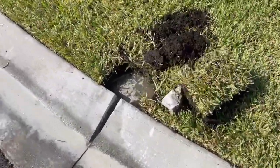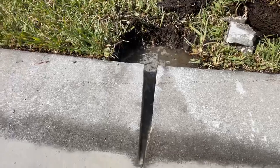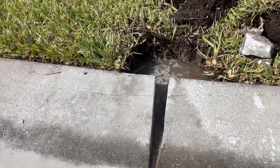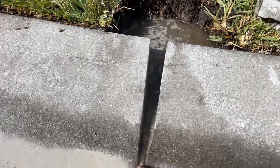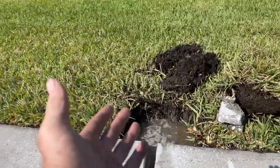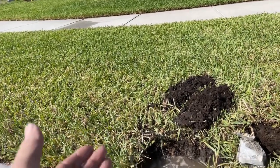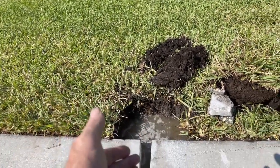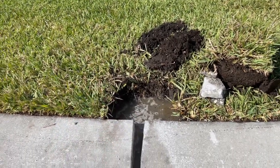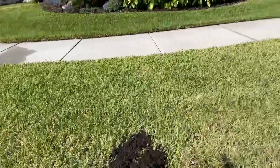It doesn't drain down, and that's because underneath that is just solid concrete. So we've made several cuts — there's another one — and if you look at our little V, it looks really good. We've got really nice cuts, and you can actually see the water flowing out. It comes right out. This is totally saturated — it doesn't look like it, but it is — and now we're giving that water a place to go by letting it come through the curb.